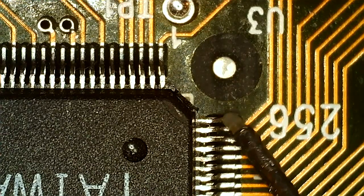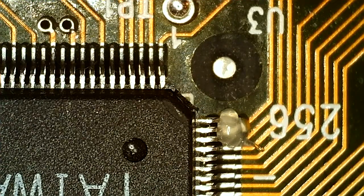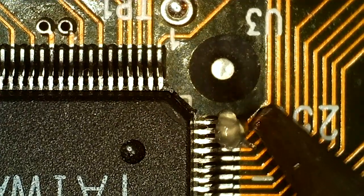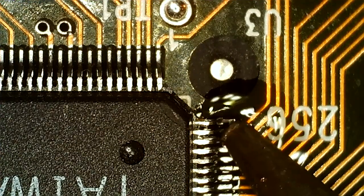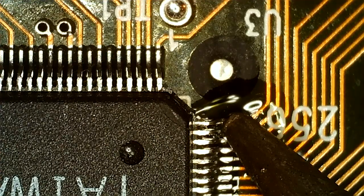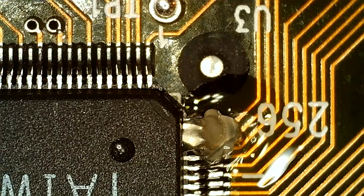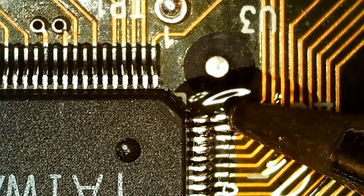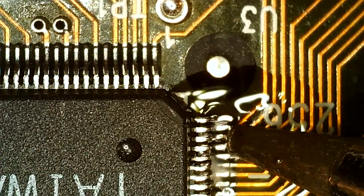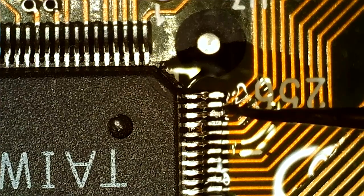So once I can actually get into Windows and do some testing, we can have a look at any kind of artifacting and stuff we might have. I suspect there might be loose pins on both TMUs and stuff. It's quite common. Also, when you're using Amtech flux, clean off the PCI connector down here, because the smallest amount, you can't even see it, will cause similar trouble.